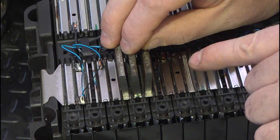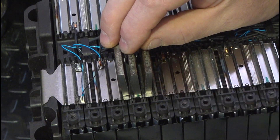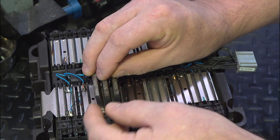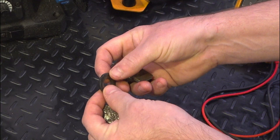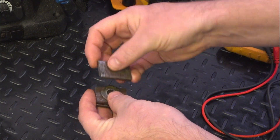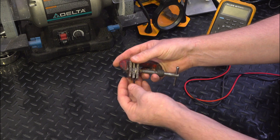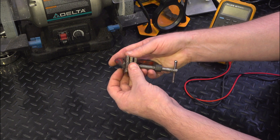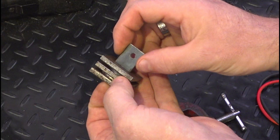We also need to find some way to hook onto this electrically. The contact area is great — that's going to work just fine. Now we'll figure out how to weld this up with a 0.1 inch spacing. I'll stack some tenth-of-an-inch washers on here to create a little air space, then weld it up, and push the washers out when the ends are welded. Then I'll use some half-inch by eighth-inch stock folded on there.